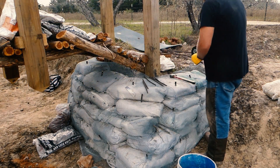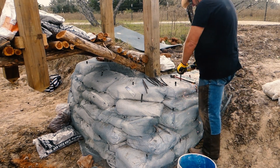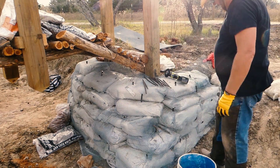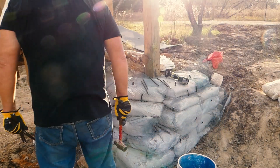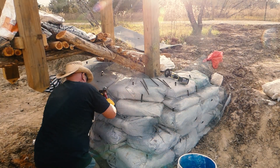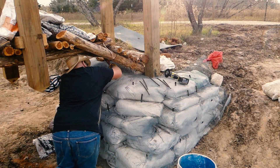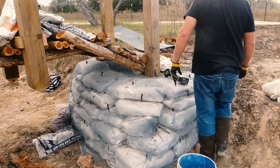I don't think I made very many mistakes for a novice. The earth bag was very, very heavy. It's wider - I don't think it's as stable as the Hyper Adobe, which was narrower. These are 18 inches wide or more. The Hyper Adobe was 12 inches wide - a little flatter, a little smaller. These are seven inches thick on average depending on how I tamped them. I also turned the bags inside out so the ears of the bags weren't sticking out to fight me and flick my mortar away. Everybody complains about the ears on the bags - just flip them inside out.